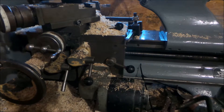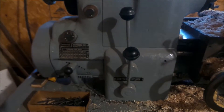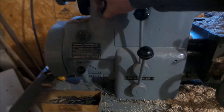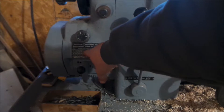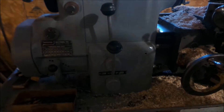You want your compound set at 29.5 and all that — set your stuff square. That's in other videos, but this is just for this one. This knob turns your lead screw on, so you want that on. Then you use this change gear box and pick which thread you want. I'm doing half-inch 13, so I've got it on 13 and 1, and then you just start it up.